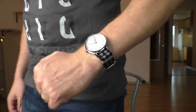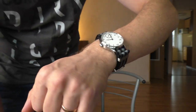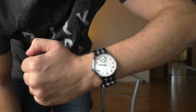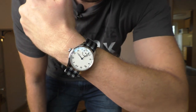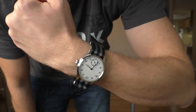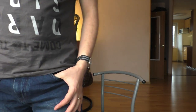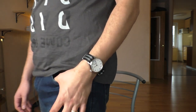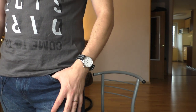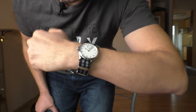For myself personally, it's either quartz — very accurate, reliable, super good — or completely mechanical hand-wind non-automatic like this. I don't care about accuracy with this watch; I just enjoy the movement itself. With automatic watches I do care about accuracy and it bothers me if it runs fast or slow — I want quartz. But with this one, it somehow doesn't bother me. Also, as you saw earlier, this movement is rather fragile — especially the winding cog. Winding it fully is not healthy for this watch; the more you wind it, the more friction and wear. Winding it halfway or less will make it live a lot longer.